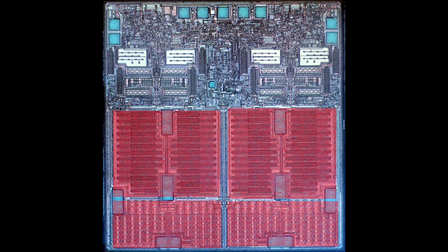Because what you need here is actually fairly large structures to handle the high wattages. Speaking about big transistors, the bottom two-thirds of the array there is basically four structures, and I suspect that's the output stage — one for each channel. The ones in the middle are the higher-powered ones and the ones lower down are the lower-powered channels.